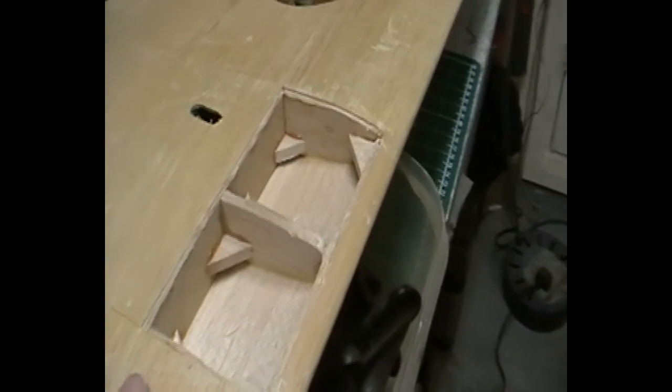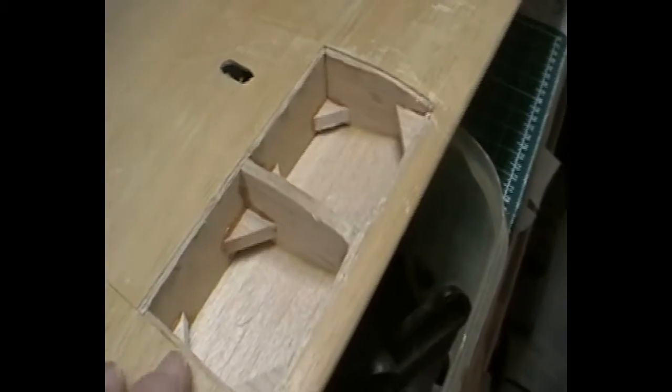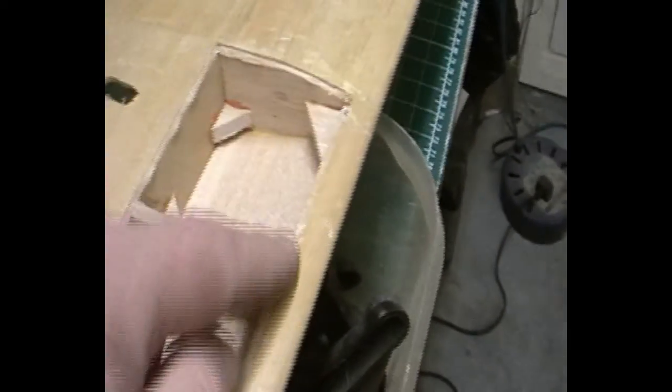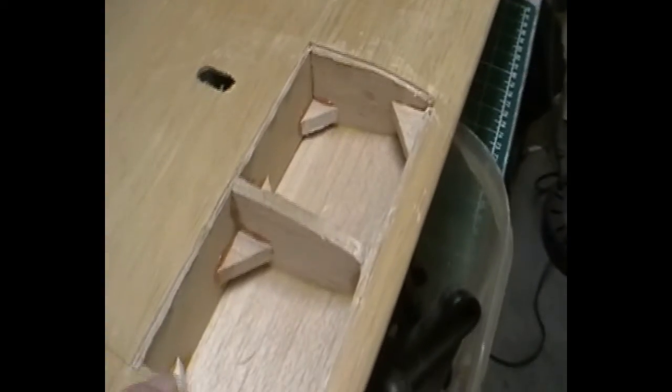I'm going by judging it really by eye. I've took this panel out, and in order to do that, I had a blade here — just pretend this is a blade. You go down, because they're all seams, as you can see, they're all seams where the panel is going. You just run a blade down there a couple of times, nice and gently at first to get your depth, so you don't go into the rest of the wood all around, right where you're cutting out.